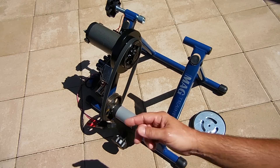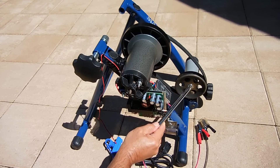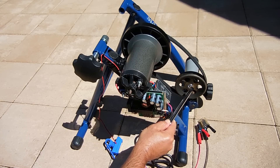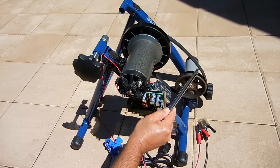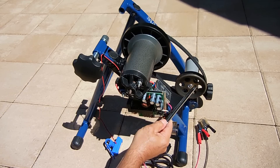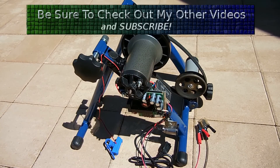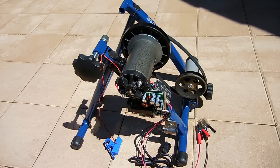You can see how I connected the shaft of that roller with the rear wheel to this pulley. It's a nut placed backwards, because inside this pulley are splines and the head of that nut locked into those splines really well. I put some spacers behind this pulley, used Loctite Blue, and it does not slip at all. The belt is a four-ribbed belt to match the two four-ribbed pulleys. We eliminated the flywheel since the treadmill motor already has a very large cast-iron flywheel, which smooths out variations in speed when the motor is under load.